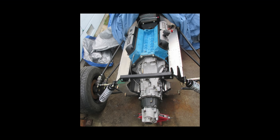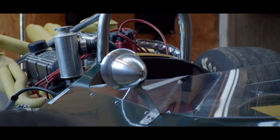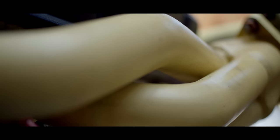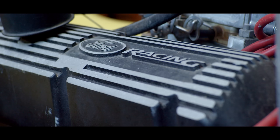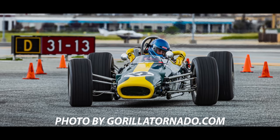You can see it's got a little steel subframe structure for the front suspension, then a steel bulkhead around the engine bay and for the rear suspension. The original car would have been aluminum all the way back here. I have to do weird things because of the way this transmission mounts. Being my first car, you pick up a piece of aluminum and it's just flopping around — it's just sheet metal. You haven't formed it or anything, and you just think, I don't want to put a 400-pound engine in that. I've gained a lot of confidence having done this. But when I did this, I put a triangulated steel structure back here and just covered it in aluminum to look like a monocoque — so you didn't know I was cheating.